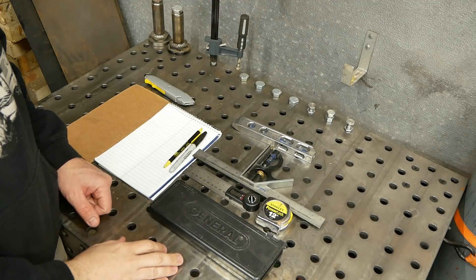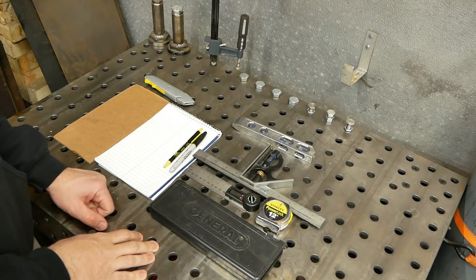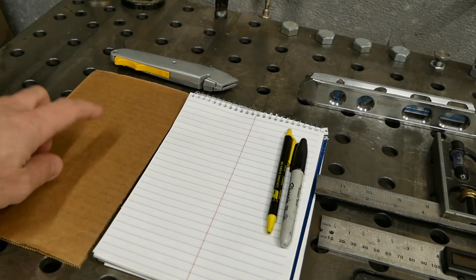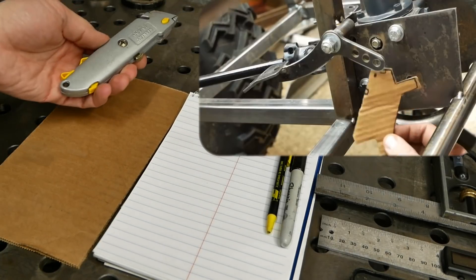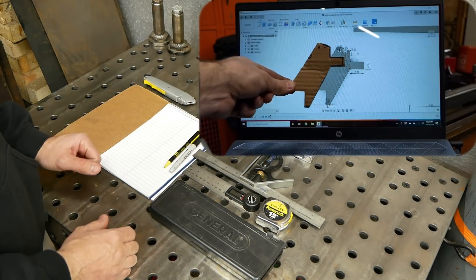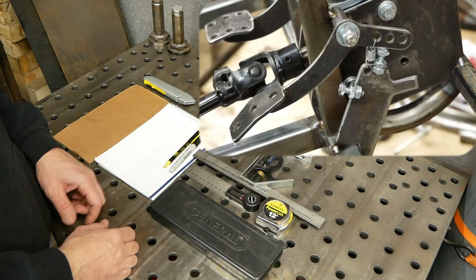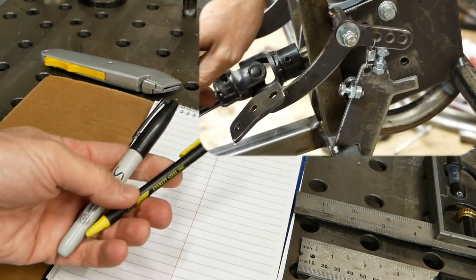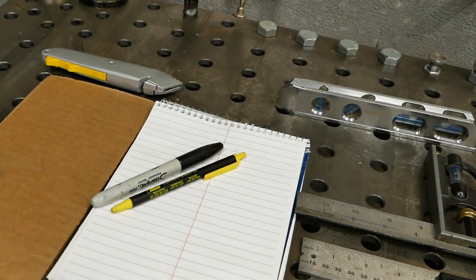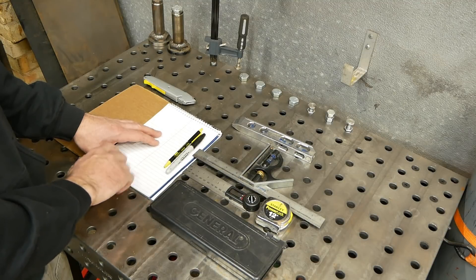So here's a wide range of tools I use. These are all pretty affordable and if you do any metal fabrication in your shop there's a great chance you already own these things. I'm going to start off with some of the simplest: a piece of cardboard and a box knife. You can use this for cutting out actual physical parts if you're really trying to double-check your fitment before putting anything into Fusion 360. A Sharpie marker for marking metal, a ballpoint pen, and a pad of paper for marking down your rough draft of what your parts are going to look like and your true measurements.